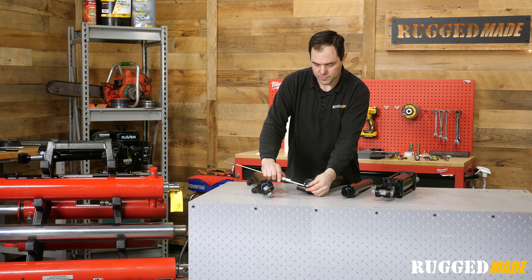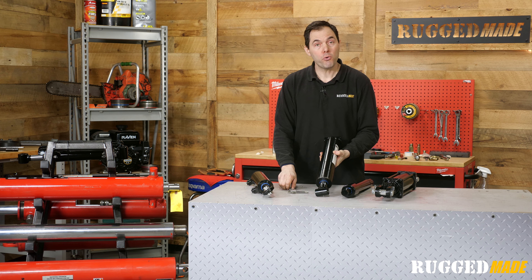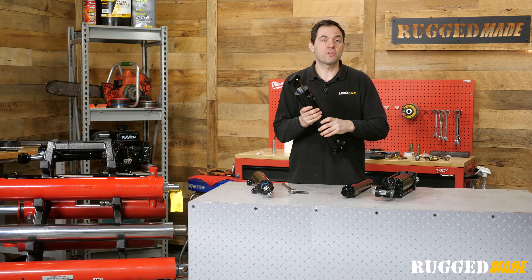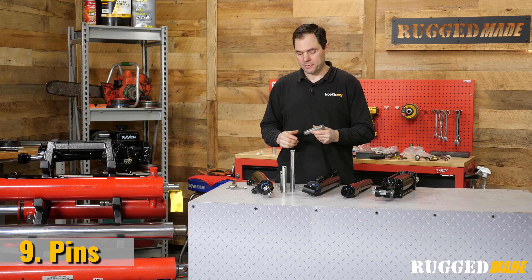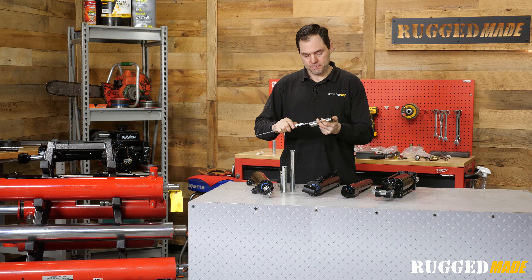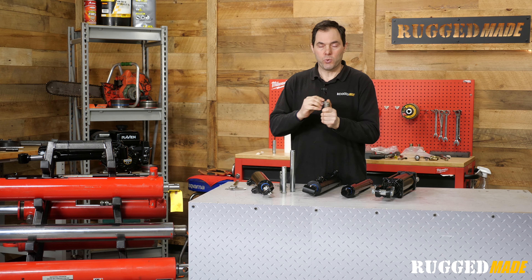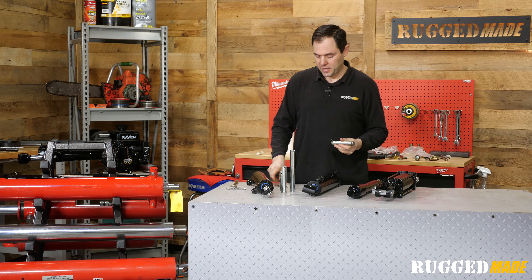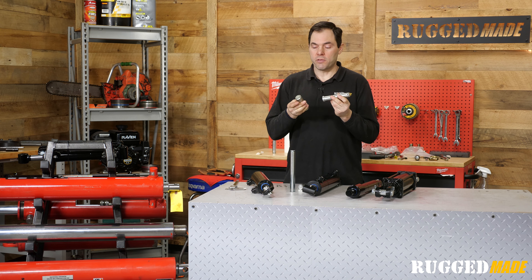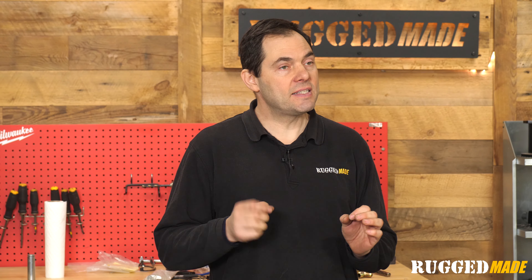Check the dimensions of the mount: check the length of the tube or the clevis, check the gap, and measure the diameter for the pin. Measure both ends because the tubes can be different lengths. Also, some mounts are designed to be greased — if you're replacing a cylinder with a grease fitting, make sure the new one has one as well. Most cylinders mount with some kind of pin, so you would want to measure the length and diameter of the pins. Here we've got a 4.6 inch pin in length and 1 inch in diameter, retained with a spring clip. Some pins are held in with cotter pins. Replace pins if they're worn out, and keep in mind your machine may also have a bushing that the pin sits in that needs to be replaced.